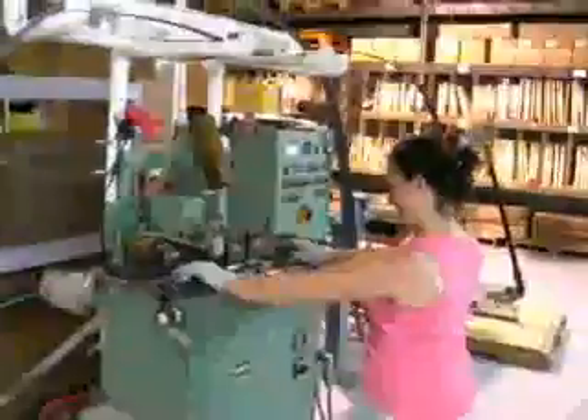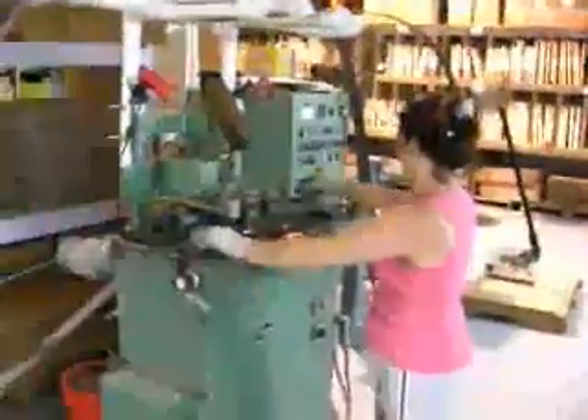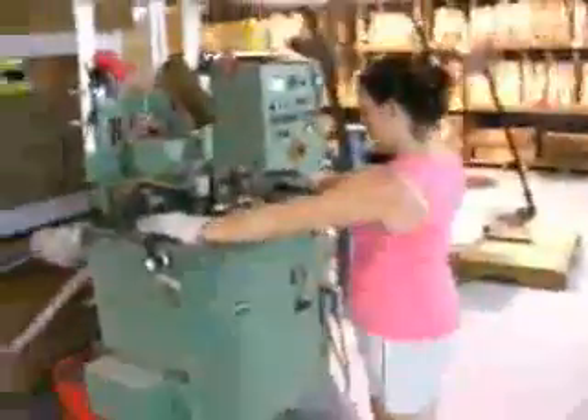Good burn — and that's the way the big blades are welded. Now we go for the anneal. Can you see that little burn? That's pretty. You have to get up to that color and hold for a period of time to stress-relieve the metal, get all the molecules back and hold them properly at the weld end. Is it 25 seconds? No, we get 45. 45 — it's not long enough. All right, here we go. Finished. Now we're finished.